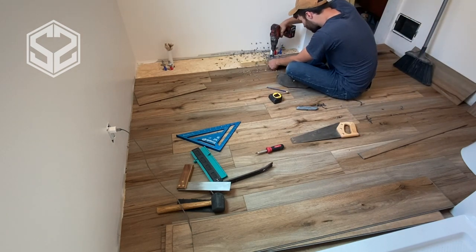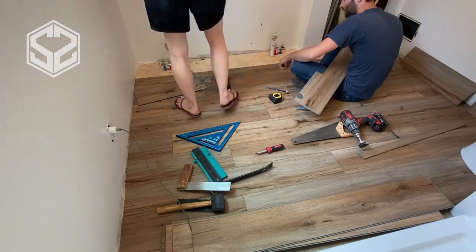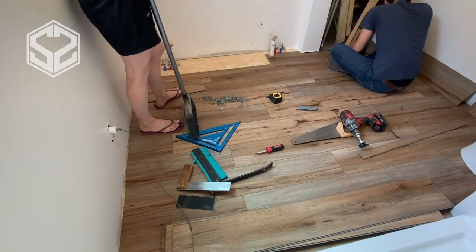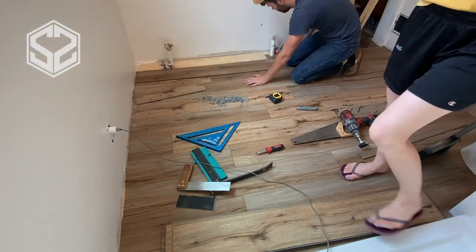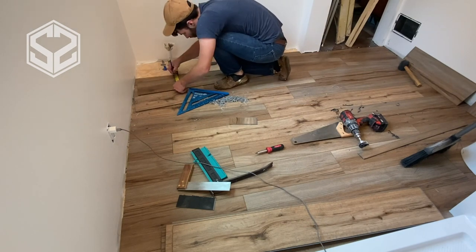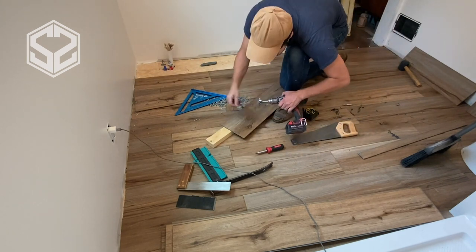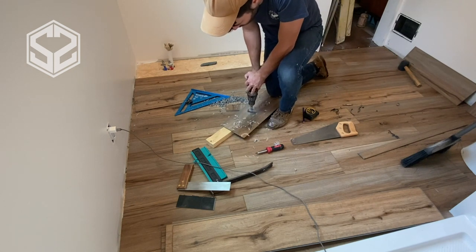This last row will need to have a few holes drilled out for the drain and the supply lines. For this you can easily just use a drill — I'm using a Forstner bit, but if you have a hole saw or just a really large drill bit it will work just fine. Now this makes a huge mess with shavings everywhere, so you want to make sure you sweep everything really good before laying down the floor, because that will really mess up the end result — there'll be lumps and uneven sections on the floor if you leave all the shavings under there.